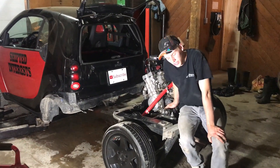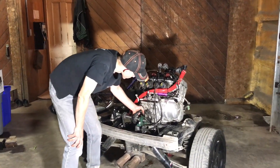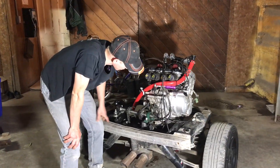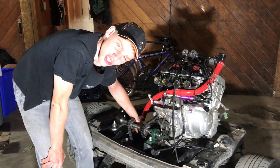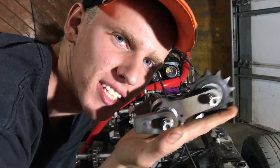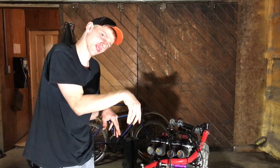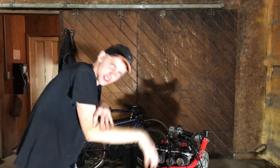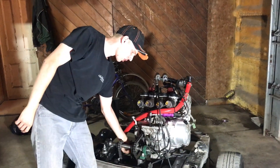So it's out of the car again. Here's our first problem: the motor's tweaking a little bit under the many horse. The second problem is this mount's a little crooked. The third problem is these chains keep coming loose - no one likes loose chains. So I have this fancy gizmo - basically it's a big heavy-duty 530 sprocket on an arm that tensions with a big spring, and we're going to make a bracket to put that on there so we can tension this big long chain.